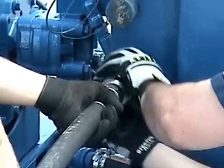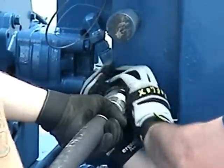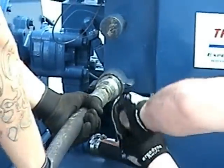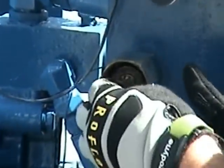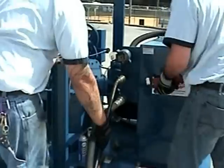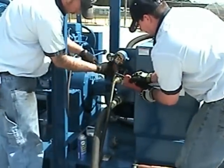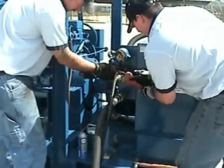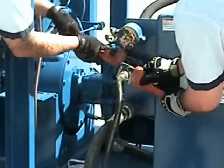When installing hydraulic hoses, sometimes it is necessary to tap fittings with a hammer to ensure they are fully seated. The power unit is equipped with female hydraulic fittings to couple to the male end on the hydraulic hose set. For the middle line or bypass line, it is necessary to use the pipe wrenches to fully tighten the line. It is the smallest size of the three.